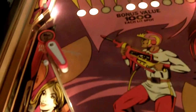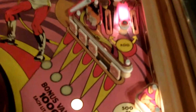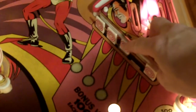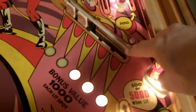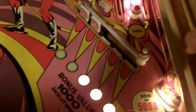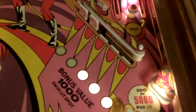You'll see some playfield wear down there, which I specifically asked the seller if there was any playfield wear from the flipper scraping the playfield and was told no. Also told it was 100% working, which it's not. One issue I had was with the five-bank target here. When you knock down this target, the lights would come on for all three of these. If you hit these two targets, no light would come on. It turned out that somebody had wired the bulb from this target to this target to this target, so you knock one down and it just lights all three bulbs at the same time. It still scores it as only one being knocked down, but the lights were all wired wrong.